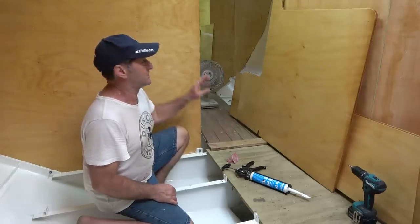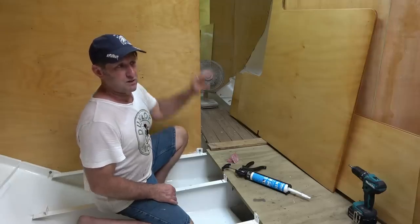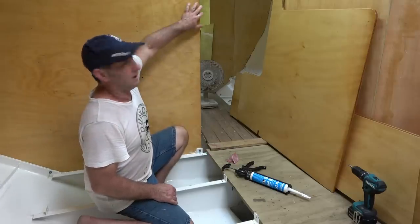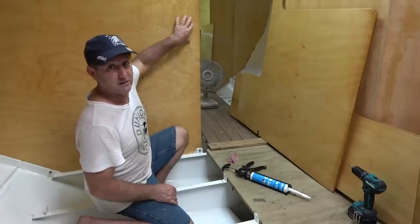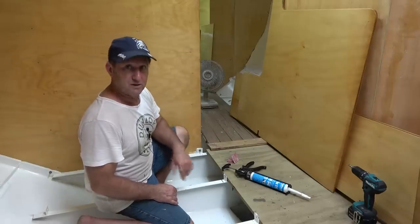Now the other thing is, wherever one panel needs to be joined to another panel, it will also be epoxy glued. So after I've sanded these hull floors and cleats, I'll mix up some epoxy glue that I'll smear down this panel here on the end and have that joint connected with epoxy glue. Then screw it in place to hold it, and that should be that. Then it'll be on to the next panel.